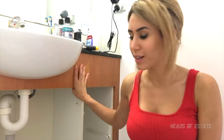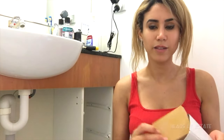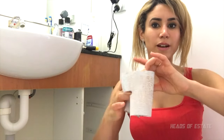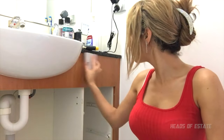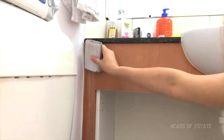Now that you've sanded your main doors and cabinets, it's time to sand the frame of your cabinet in the same way with 180 grit sandpaper — all the way across the area — then clean it down with a damp clean towel and leave it to dry. Note: I have a sanding block underneath my sandpaper for better grip, and I can keep moving it around as I go. Once you've sanded and cleaned everything until it's nice and soft, you'll be ready to move on to priming.